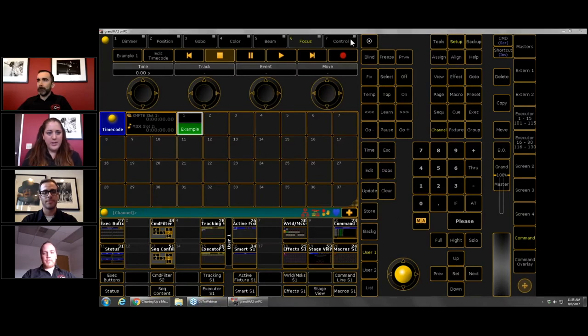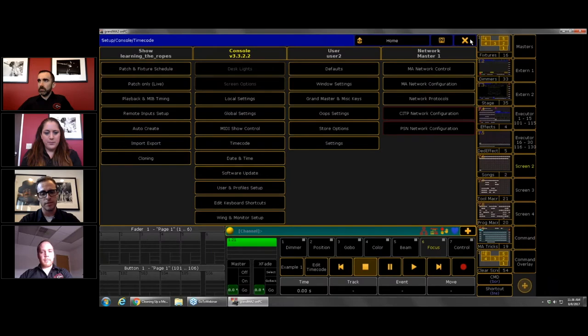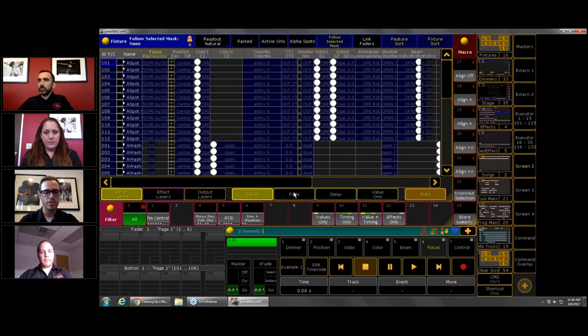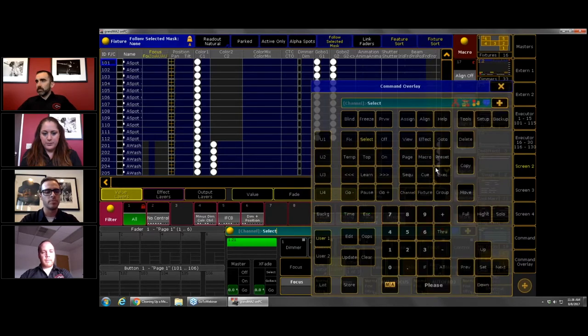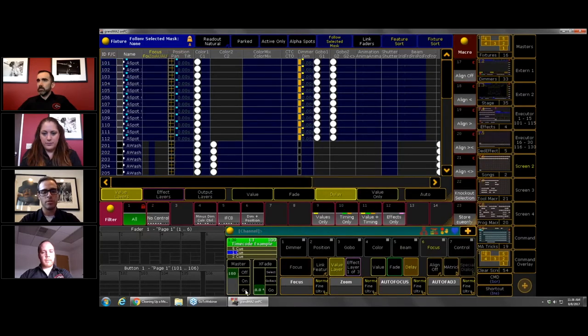Spencer, I got one for you. My fixtures are taking a really long time to fade, or actually, I'm bringing it up in the programmer, and nothing's happening. I'm not getting any control of my fixtures. No control of fixtures. Okay, well, I always like to start off with the fixture sheet. Looking at the fixture sheet, you have that individual fade and delay layer that you can pop into. It's just like looking at your values, but in timing land. So look here, select your fixtures. If you have fixture sort, they'll jump to the top of the list. Select the executor that's running that cue. Hit go, and you'll see, okay, I got a position timing of 0 seconds. Maybe I need to go in and add a fade time.